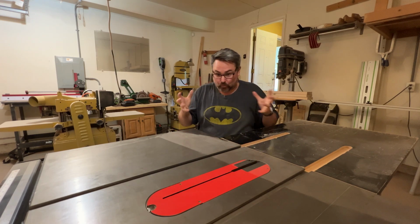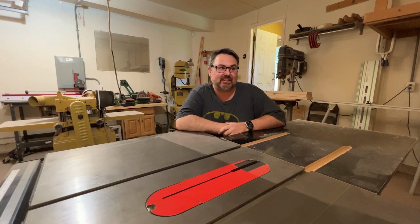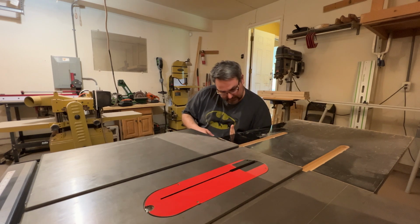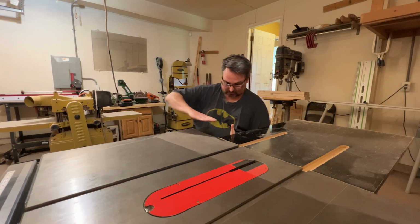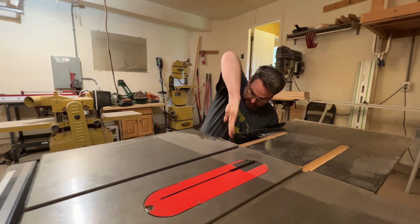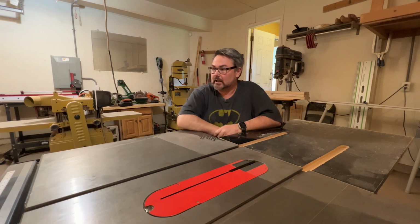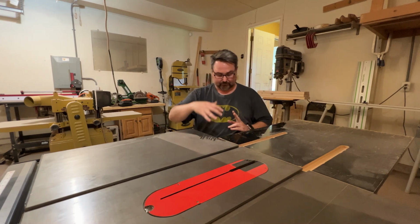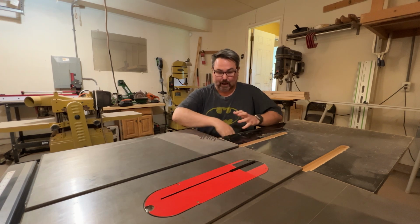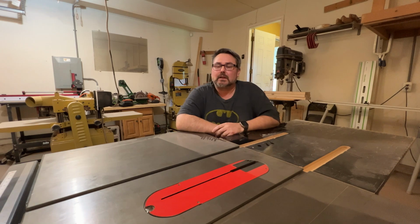And you know, when your face is close to an exploding grenade, usually things don't go well. So if the router bit comes up out of the table like this, I have to put a board and cut it this way, and then I have to put a board and cut it this way. And that's where things get sketchy. When I have a big piece of wood vertical on this router bit, that has the potential to blow it apart.